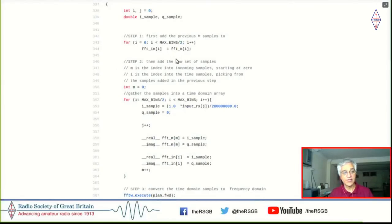And the way you have to do this is, if let's say 1,000 samples are coming in, you actually combine them with the previous 1,000 samples. And the reason why you do that is, at the start of a sine wave, if there's an abrupt start, which is not at zero, but let's say at 100, you need a continuation saying that earlier it was 99 and now it's gone to 100. Otherwise, the software might think that it's gone from zero to 100 and give a sharp click there, because there's a sudden spike. So in order to avoid the software from thinking falsely that there are spikes, you basically show continuity from the previous set of samples which have come in.